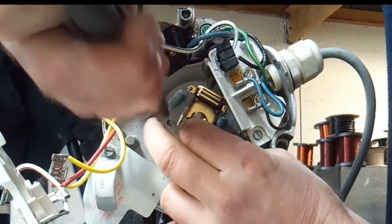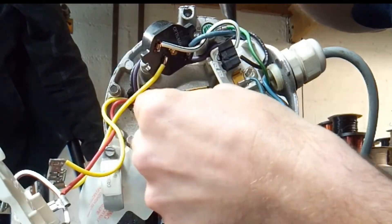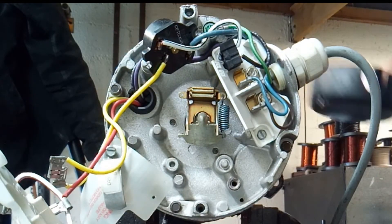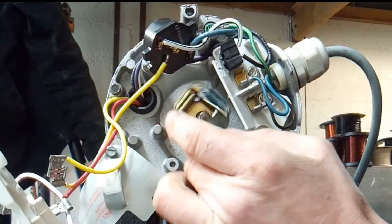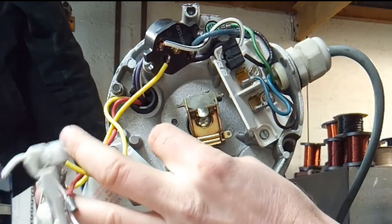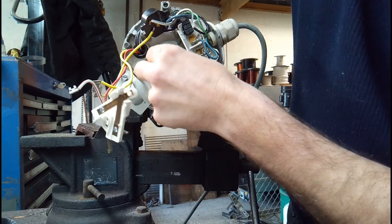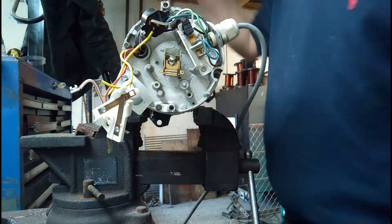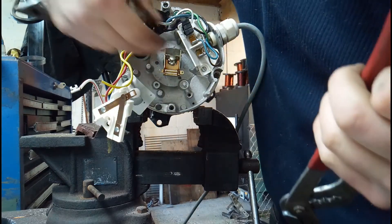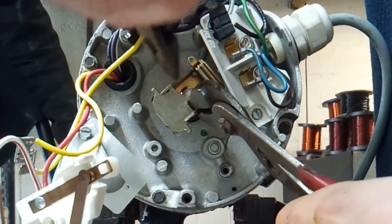You have to take the springs off first — you just slip them off one end and then they are hooked on the other side. The whole idea of this rotary part of the centrifugal switch is it has a little weight on it, and it throws out when the speed of the pump is about 75% of its rated speed. This in turn open-circuits the start winding, because this is just a cap-start single-phase motor, which basically means that once the start winding is out of circuit it's just running on the run winding only.